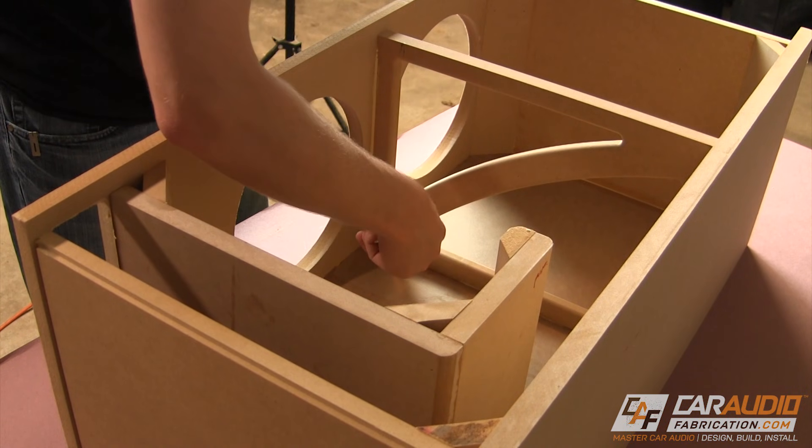However we have that wire going through the box, we don't want any air to leak. We often put a lot of effort into bracing the inside of the box and even using a double baffle on the front face to make the box as strong as possible so that we don't lose any acoustic output. So when you make a box as strong as possible, I really disagree with the idea of adding a terminal cup. A terminal cup is basically a plastic cup you attach to the side of the box with two wire terminals. The problem is they're often made with very thin, flimsy plastic — I really don't want to add a weak point.